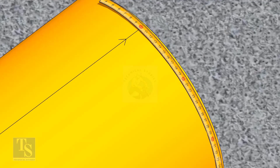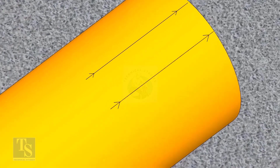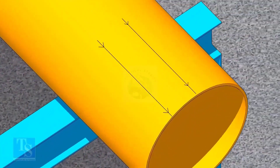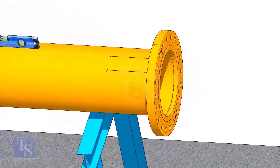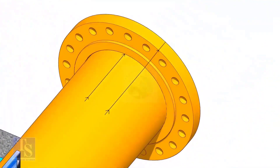Since we are rotating the flange 25 degrees anti-clockwise, mark 88.5mm anti-clockwise on the pipe as shown. Put the flange on the pipe and rotate the flange until the center line on the flange and the 25-degree line on the pipe come into alignment.